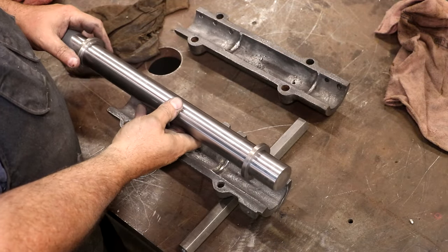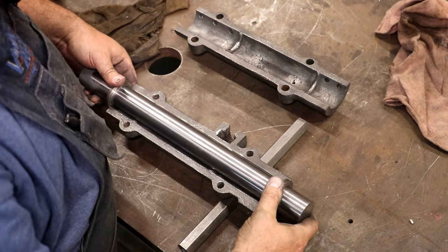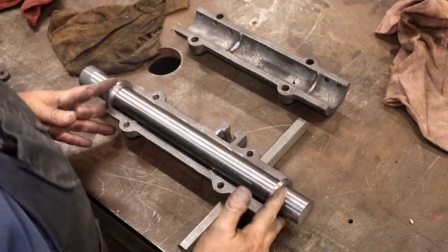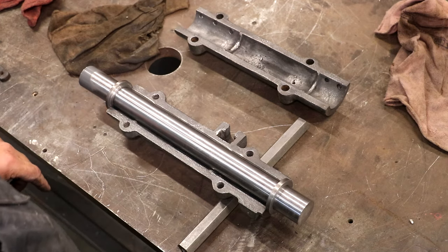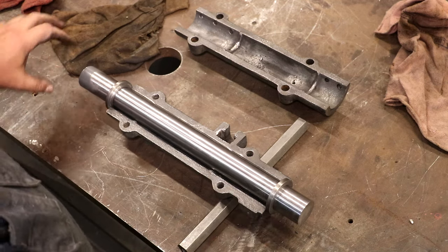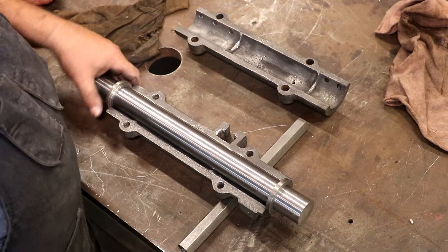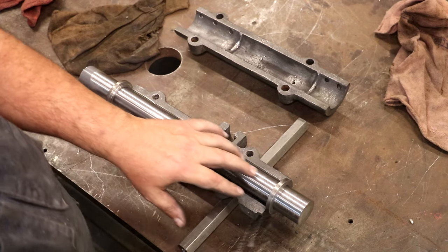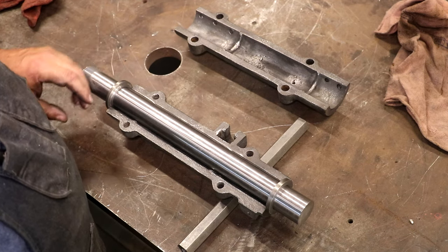All right, we've got our ring made. Let me go test fit this one and if everything works out right, we'll make another one just like it. You can see what we've done - I've put the bushings on the mandrel we'll be pouring around, and they fit right down in those ends. These serve two purposes: number one, it centers the shaft into the casting up off those little dams; and it also caps the end to help keep the Babbitt from pouring out, though we'll still have to dam it up a little more using some damming compound.